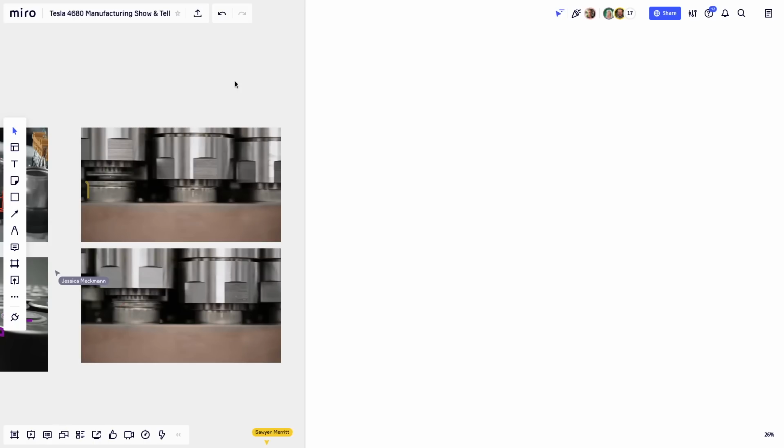Because like the lid, you would have to have it perfectly centered. These machines, you can't push the cap without it being perfectly centered, or else these machines have probably enough force to distort the thing. So having a positioning system that centers the cap onto the machine, and the machine that pushes the cap into the can, this all has to be lined up. But this hole that's in the middle that the pin is currently going through serves a whole other purpose.